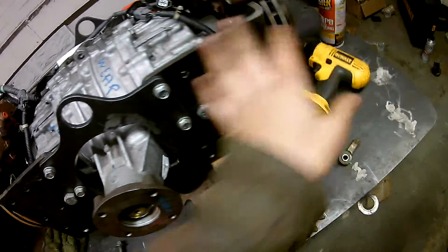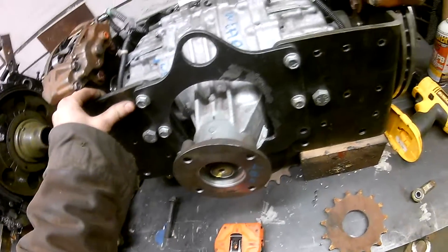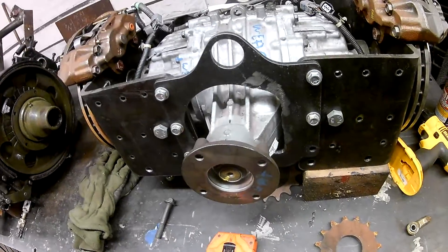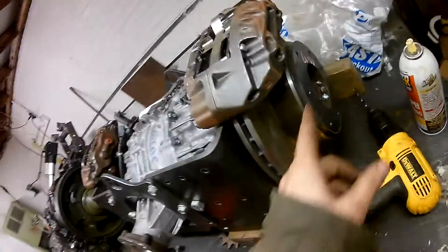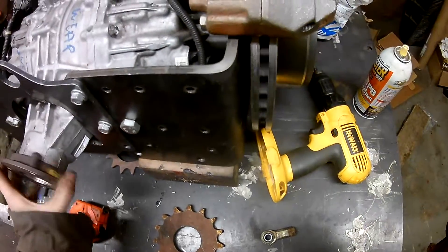This portion right here was all built by me — it's a subframe that bolts up to the Acura MDX so you can mount your calipers. You also get a good mounting surface with mounting holes so you can bolt it onto your frame. I might sell plans for this in case anyone else is interested. There's also a little bolt ring there for your disc rotors. It turned out pretty good in my opinion for being mostly dumb iron.